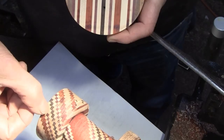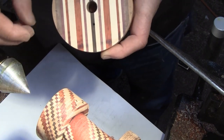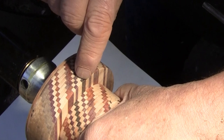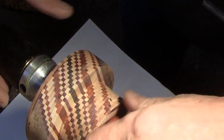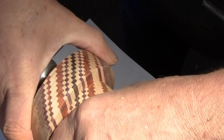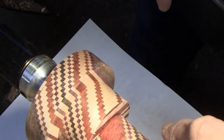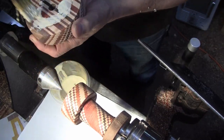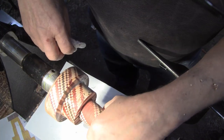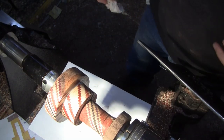The pieces on here are from the same blank. I'm looking for this pattern here — I'm picking this wider dark piece, which is wenge. I'll put this on here and just barely touch it, then look down — there's that same wenge. If I rotate to that, you can see the pieces next to it are lining up. By rotating that same direction, I'll get that pattern to go all the way up. No matter what shape I turn it, we'll have that pattern going up. I'll glue it on. Those corners look good and these corners look good. I'll be back in a couple hours.